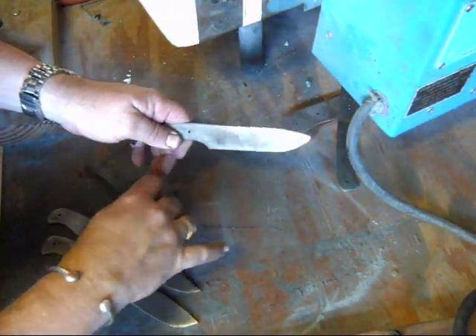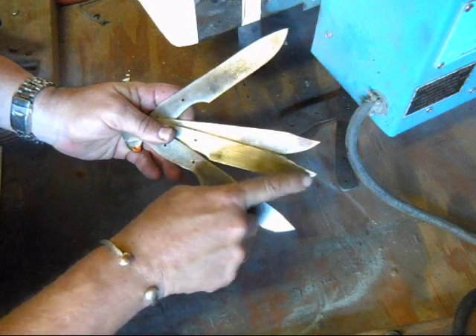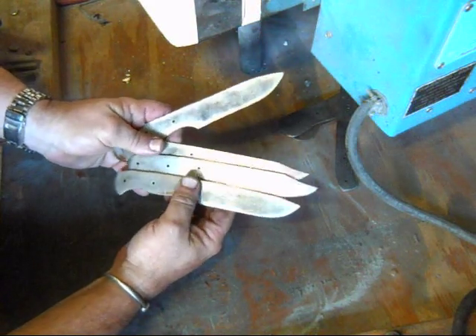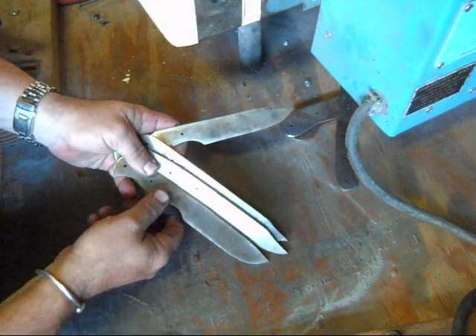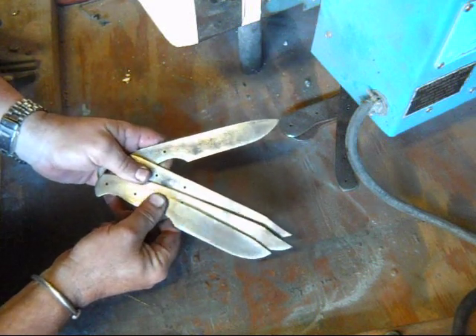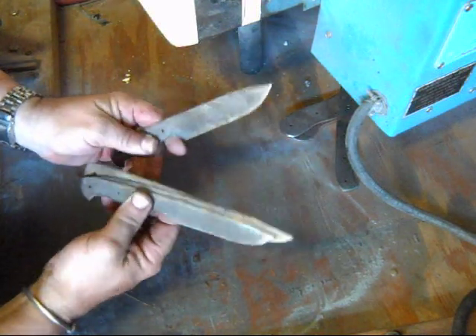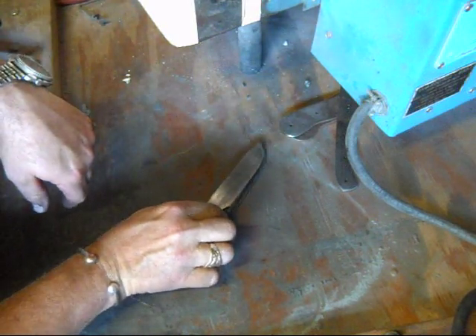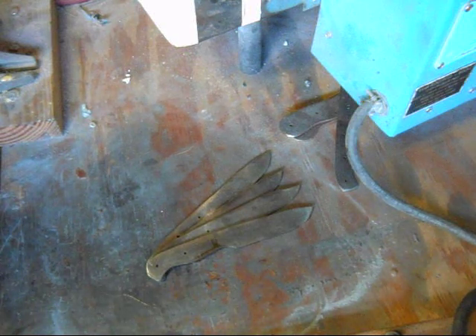Here are the blades — this is actually another set; I'm doing quite a few of these in this size, some with a clip point and some with a drop point. Here they are after the heat treat is completed. Now to complete the heat treat cycle you have to temper them. Remember, heating it up to 1525 and quenching it — cooling it down very fast — makes it hard, but it also makes it brittle. So tempering at 450 degrees, same as in the other videos, and then cleaning everything up afterwards takes some of that brittleness out. I've been getting good results this way, so that's the way I'm going to continue to do it. But I'm always looking for a better way — I want to improve the heat treat. Remember, in my opinion, the heat treat is probably the most important part of knife making.